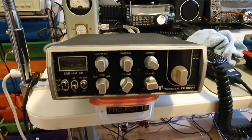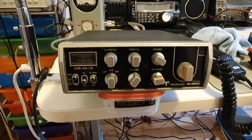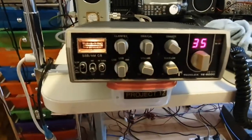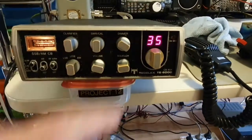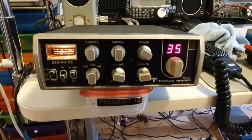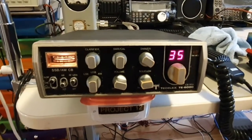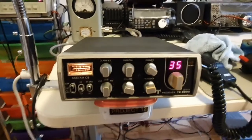The first thing - one of the first things we're going to do - is a full cap replacement on the radio. We'll update the brights on this and obviously put in a white LED. The display needs quite a bit of cleaning from the inside, and there are a lot of scratches on the outside, so we'll clean that. Looking forward to bringing this series to you.